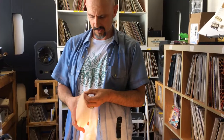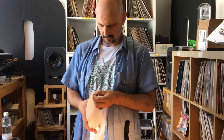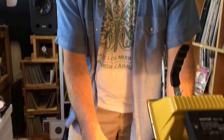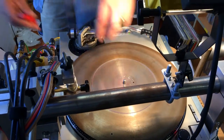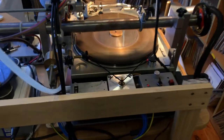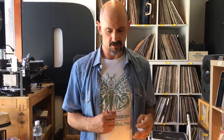We're cutting on transparent 7 inches, so I've got to take the protective coating off. That's the disc uncut — drop that on there, with a puck in the middle to hold it down. There's an additional belt that runs around a big metal plate here, a belt drive alongside, synced with the direct drive of the turntable, which helps give it even more stability.